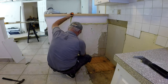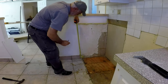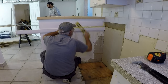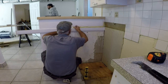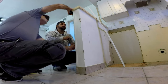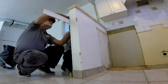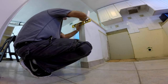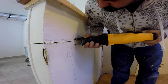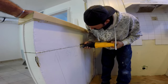As you will see during the install, this was important to us because the sink drain being outside the wall instead of inside it means the cabinets need to be offset. Another plus is the custom cut granite counter, as you'll see further along. We start with the removal of the cabinet next to this half wall so we can cut it down to the same height as the cabinets and extend the new counter over the wall, creating more counter space and enabling stools on the other side, making it a dining counter as well. We measured and marked the height on both sides, drawing a straight line with a straight edge and checking the level. It's very important to make this wall the same height as the cabinet, not including the counter. I confirmed this height measurement with the cabinet maker and installer.